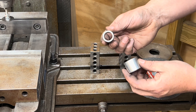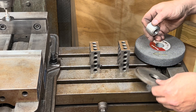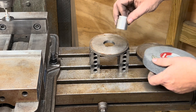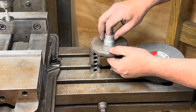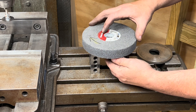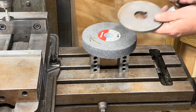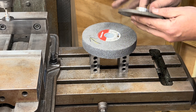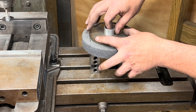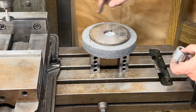This is a one and a quarter inch down to one inch, so I'm going to use these to line up. This will be my base, and then what I'll do is take the one and a quarter and then the one inch to make sure everything's concentric. Drop that in and do the same thing on the top side. So now I know I have both the top and bottom plate concentric with each other and set concentric with the grinding wheel.